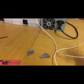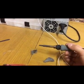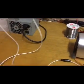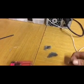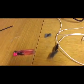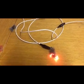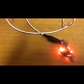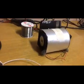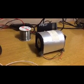There's good news and bad news. One, the soldering iron, even at 650 degrees, does not produce enough heat. It'll burn it, tar it a little bit. But if somehow that thing shorts out, and I'll use my 24 volt input as long as I can get this to stop moving around, see, it shorts out my power supply when I do that, but steel wool will definitely go, and if you add some oxygen to it, you can see how quickly this can get out of hand. That would make this a giant little fireball of chaos on my desk.